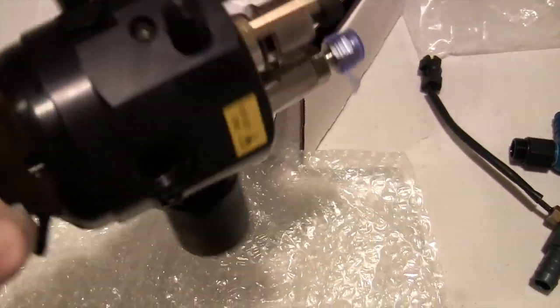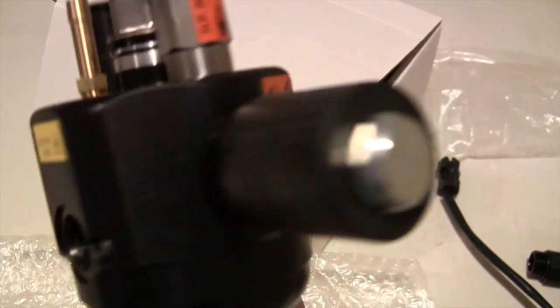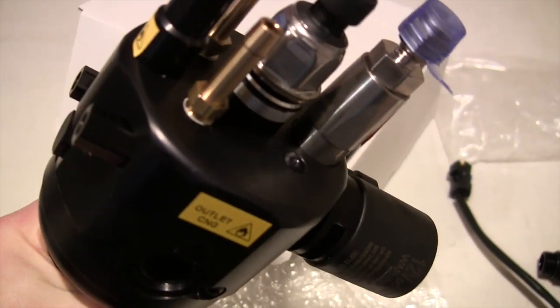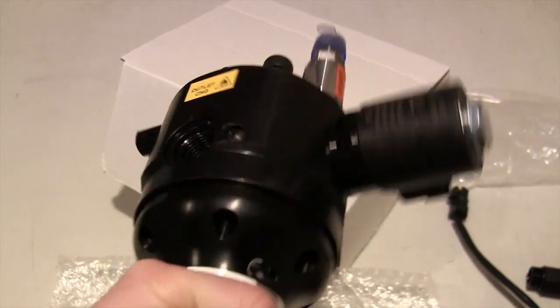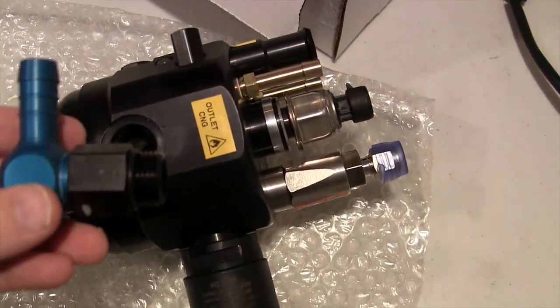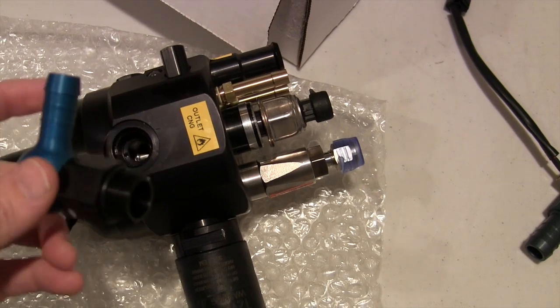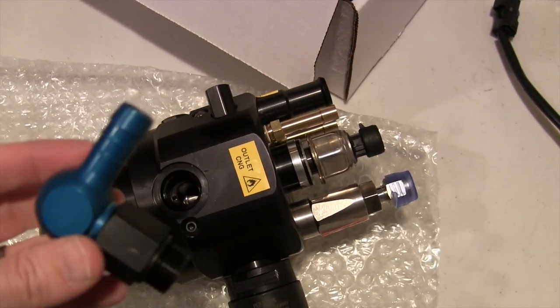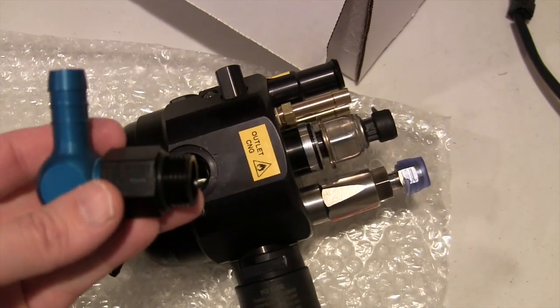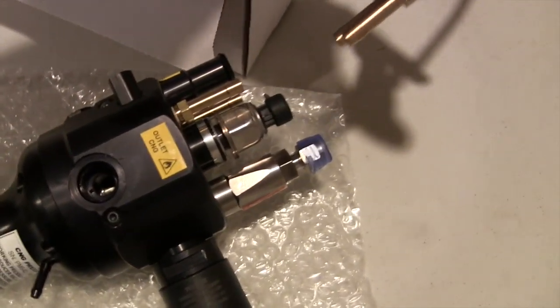When you're putting this thing together, you just don't want the solenoid to be pointed in a downward direction — this is the upright position. As long as the solenoid is not pointing down you'll be in good shape; it can lay flat on its back, lay on its side, or upright — this is the most common position. Here are the mounting bosses so it mounts up really easily. This is a 90-degree swivel outlet port, half inch or 12 millimeter, which makes for very easy installation.